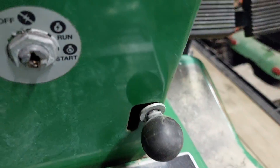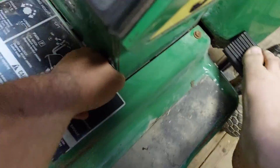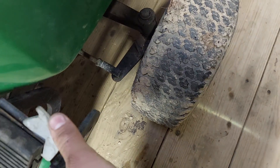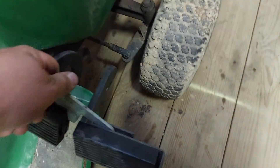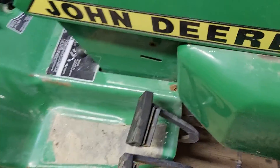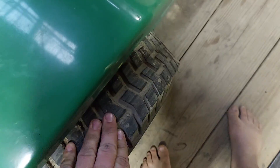This is your brake lock. If you push your brakes all the way down and drop that down, it sticks your inside pedal. If you want them both to stay down, you have to lock them together. This is your lock — it locks your pedals together because these are individual brakes. This pedal stops this tire over here, and this pedal stops this tire right here.